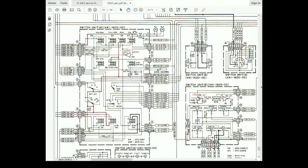VS1 goes to IF port MA. I don't know what that's all about. Interesting. And in the off position, which is the position that's actually not working, it's grounded. It goes to ground. Now it shows ground as just ground. It's just a circuit point. All grounds here are common, and then there is one. It goes out on a control wire here to ground.